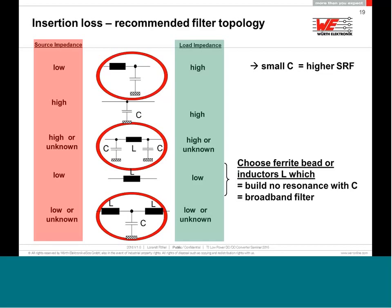If you put in a high Q factor, with domination of XL at this frequency where you want to filter and less R, it will make more bad things because it starts to ring. The filter starts to ring with the noise. So think about these different components, the self-resonance of the used components. Use low ESR, low ESL capacitors with a maximum of 1 microfarad.